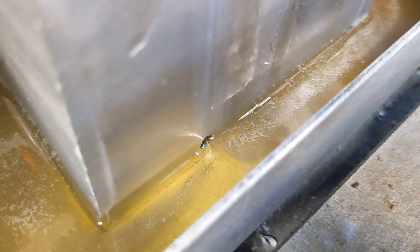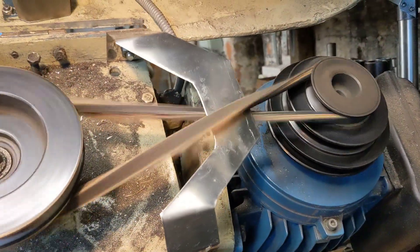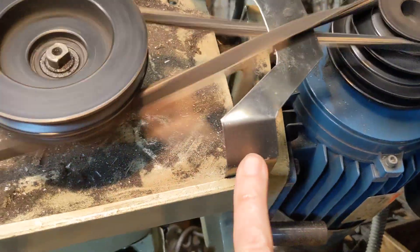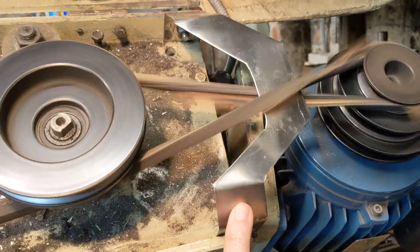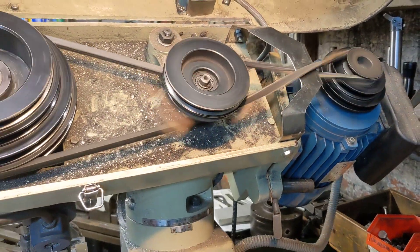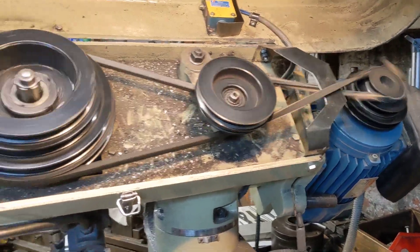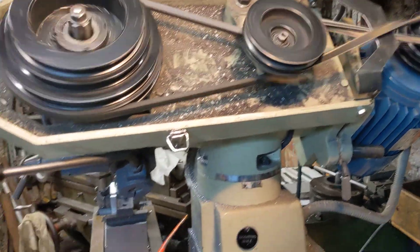No issues at all. You can see the oil going in there, being scavenged up and pushed out of the back. And on this side you can see the crisscross belt here. This special tool that we've made separates the plate so the belt doesn't fray itself to bits. It's just an old belt — I wouldn't run it like that for a long time, but certainly for the purposes of our test it's quite a success.